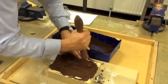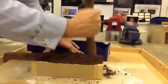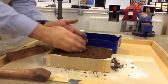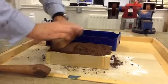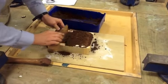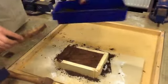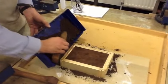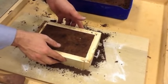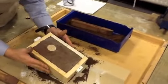As we get to the top, we want the sand to be slightly proud of the wood. Once nearly finished, get a piece of wood and scrape the excess sand off. Be careful not to contaminate the sand with talcum powder — scrape it back into the box. We have a limited amount of sand, so the further we can get it to go the better. That's the first half of the mould done. Carefully lift it up, turn it over — that is the first part of our mould.